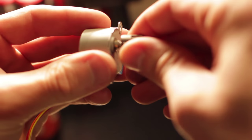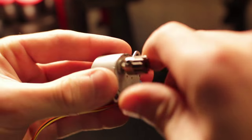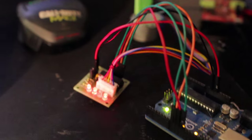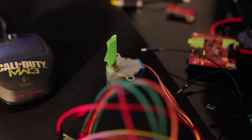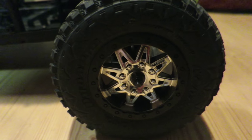And then from there, I wrote a really short Arduino program. Really easy. It's basically having four digital pins and then setting one of them high each interval. That's how that specific stepper motor works, because they've already got a driver, a little board that runs them. So it's just trucking along, and I can change the speed, but right now I'm just testing it out.